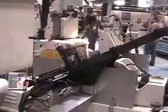The machine grinds a two-diameter part. The major diameter is 5/8-inch diameter, plus a half inch on the table, taking 3 thou from each diameter.